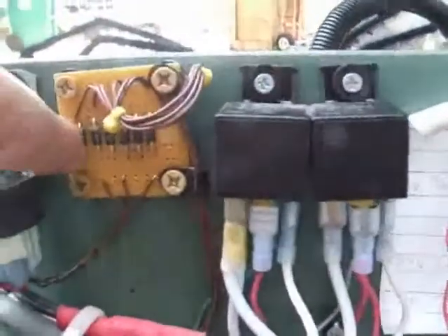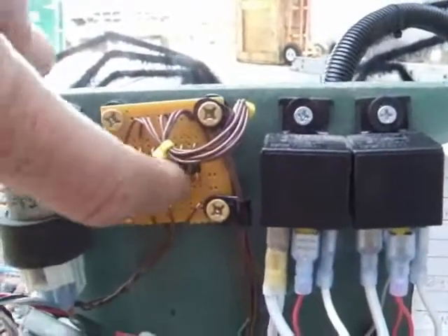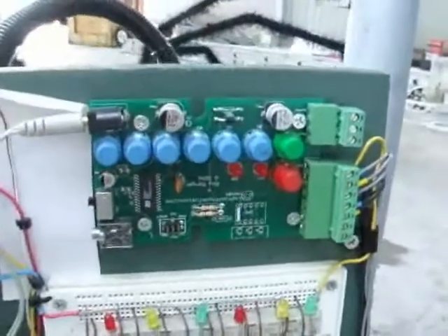The diodes tie into the brown wires and basically keep the leg motor from feeding back into the other circuits, so that keeps it all separated. Whenever we're doing anything with any of the other solenoids, the legs are going to automatically move during the time the solenoids are energizing.